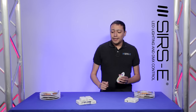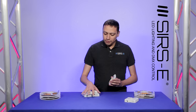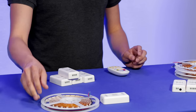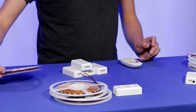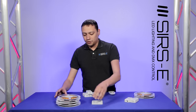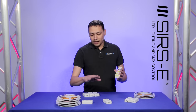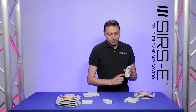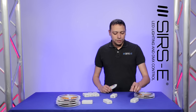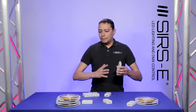And that's what I mean by stackability — that's what makes this so versatile and easy to use. Not just that, per each individual controller you can also have not just one 5-meter reel of strip, but up to 2, 3, or 4. So now I've got 4 strips on 1 controller in 1 zone, and I can repeat this. That means I can have 8 strips on one zone and continue on. Just to clarify a little bit, let's say I have zone 2 — this is zone 2, I have 2 strips in here, and now this can be repeated multiple times.